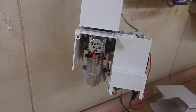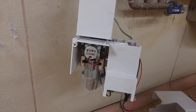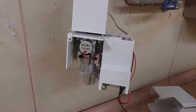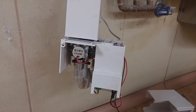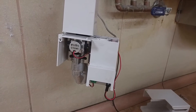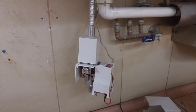I then proceeded to take that valve apart, figured maybe something got clogged up in it — some sediment. I was correct; it was either not working and needed a new solenoid valve, or something got jammed in it. We took it apart, cleaned it up, put it back in, and got it working. Cleaned out the aerator, so now this sink is back up and functional.